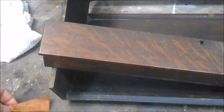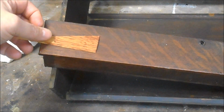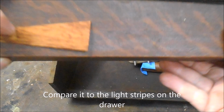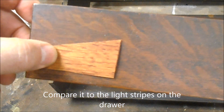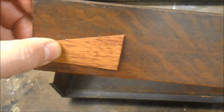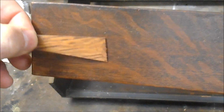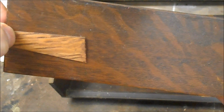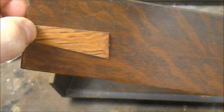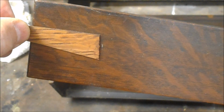So the first thing I did was take some strips of oak veneer, and I stained this one in walnut, or American walnut, which is the redder of the two walnut colors. And you can see for a base color, that's not too bad. So that was a good start. Then the next thing I did was take a piece that was stained with that same dye and glaze it with some black, and the black settled right into the grain, which is beautiful, but you see we're still off. We don't have that richness.